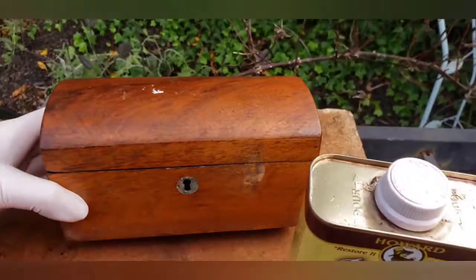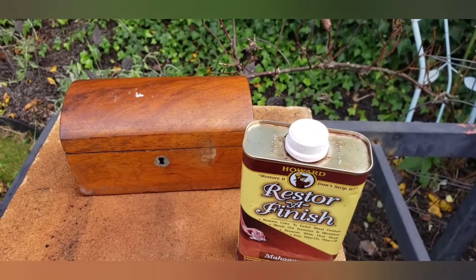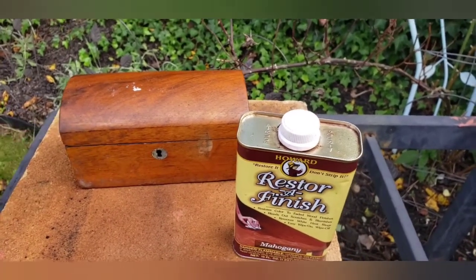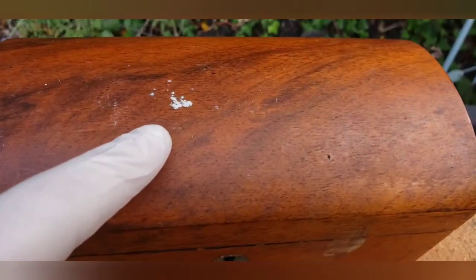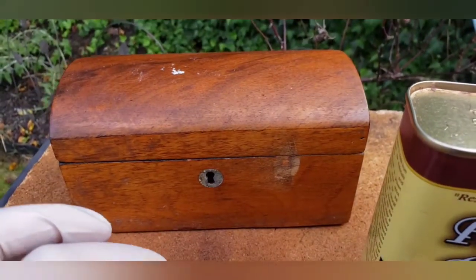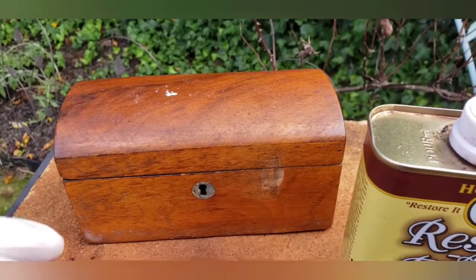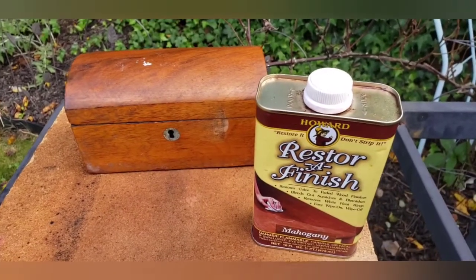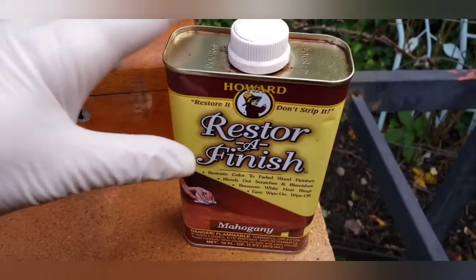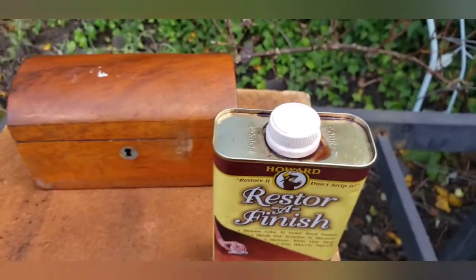In order to use this product you need a couple of little supplies. You can use an old beat-up rag, a steel wool pad, or a paint brush. With something heavily flawed and scratched, your best bet is a very fine grade steel wool pad — I believe it's grade 0000 or grade 000 — and you can get them for under five bucks on Amazon or at your local hardware store. First, shake up the product because it has pigment in it and you want to distribute that pigment all around.